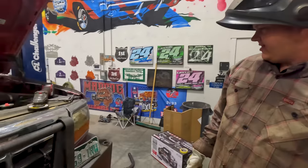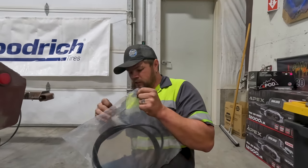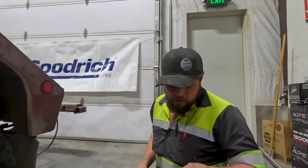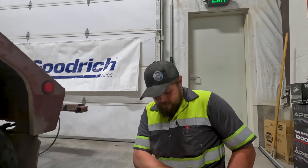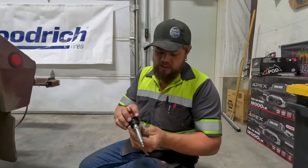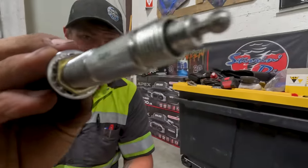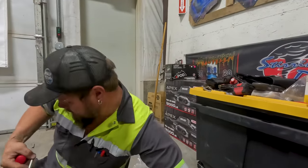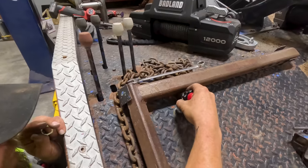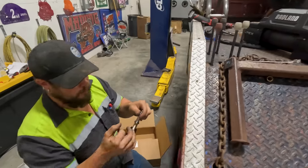It's already looking better — look at it. The new cable arrives. This cable makes it where you can idle the truck up to run the winch or the booms and not have to have someone in there pressing the gas — this will do it all for you, except run the winches. I'll get the handle installed, and once the handle is installed you press the wire through to get to that fitting — there's a ball on the end and it just slides on like that. When you tighten it all down it'll make sure it can't just fall off.